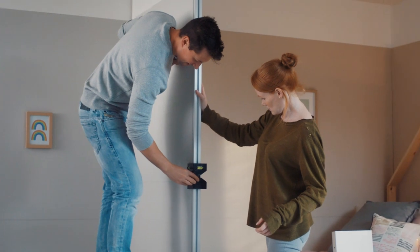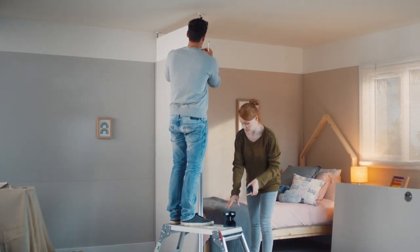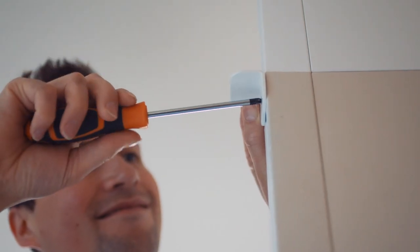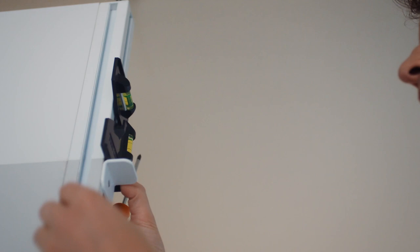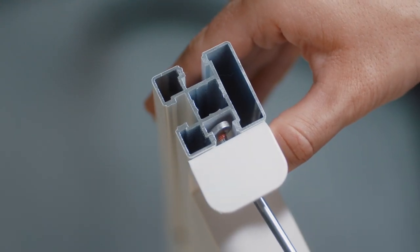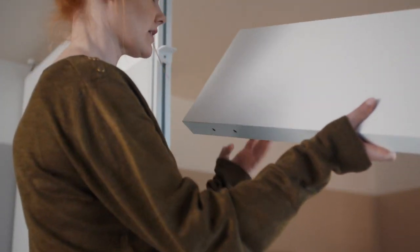Start by building one side of the room divider first, up to the gap where the door opening will be. Now attach the lug into the sliding door panel bracket and insert the complete fixing into the groove of the post at approximately two meters from the ground, in line with where the panels on the other side of the post join. Screw the brackets into the post, making sure it's straight with the spirit level. Ensure that the lug gets twisted and doesn't stay vertical. Fix the clips to the sliding door panel and clip into the posts in the same way as the standard panels.